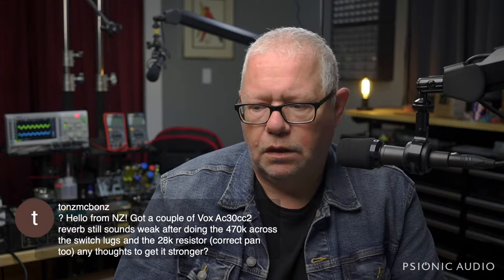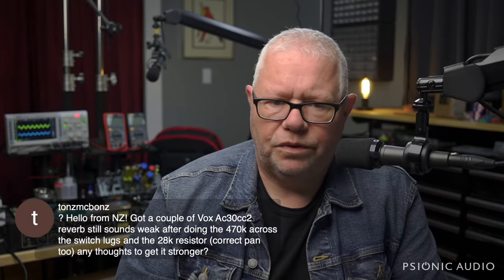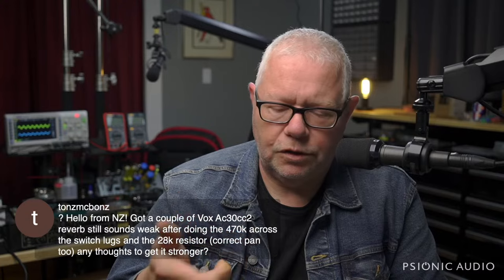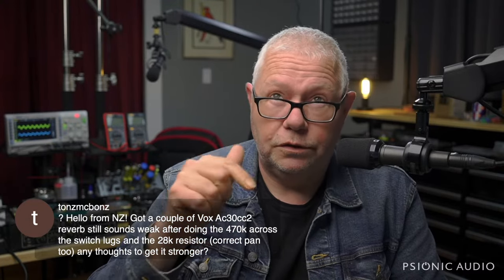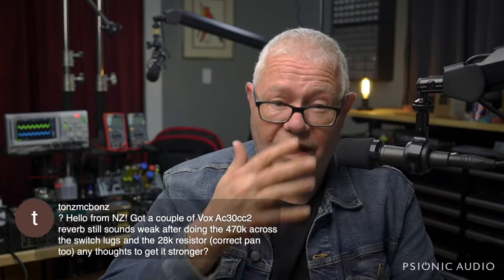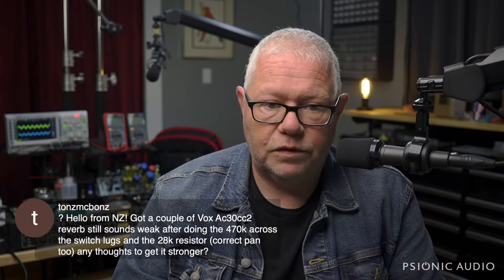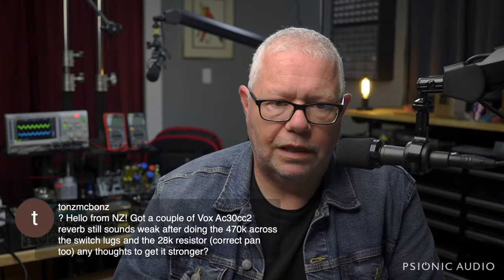character of the sound from that tank and within that circuit, I used to tell clients, don't worry about it. The amp doesn't really need reverb. AC30s are traditionally not a reverb amp. If you fix the one bad capacitor, 0.22 microfarad instead of 2.2 microfarad cap on the output of the effects loop, then you have a world of reverbs that you can put in the effects loop, which are better than the tank anyway. So I've not spent clients' monies on the reverb circuit of the Custom Classic.